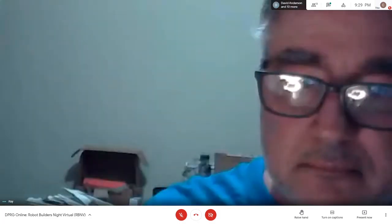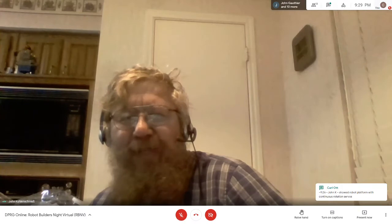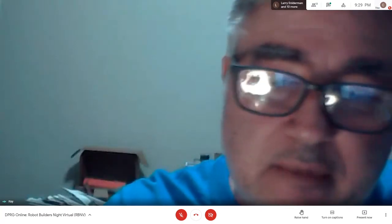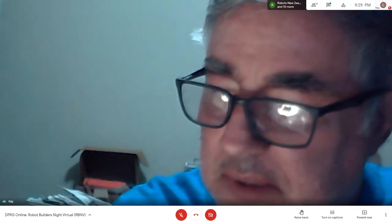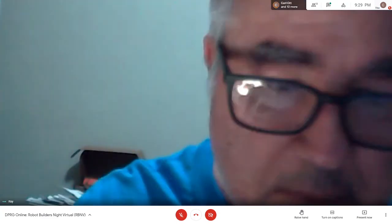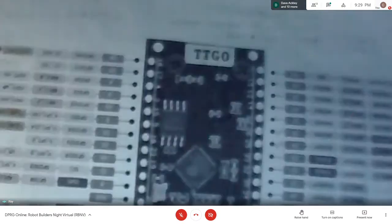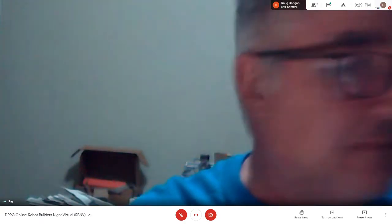Well, that's interesting. I'm waiting to see if this Instructables robot is going to be functional after I get it together. It should work about the same, I was thinking. Yeah. If you look on banggood.com, if you just put in that number, 1239769, it'll pull up the ones that I bought. TTGO is the brand name. And you can print out a pinout of it, which I always find useful, so that when you assign things to it, you can keep track of which pins you've used for what, all that stuff.